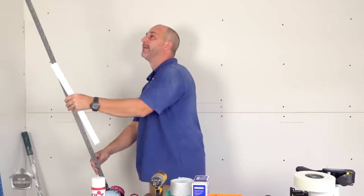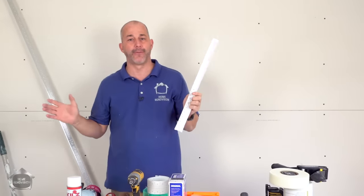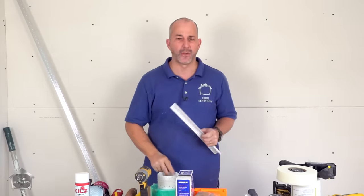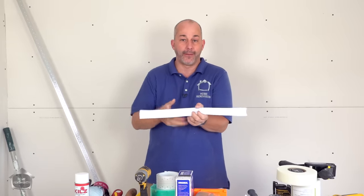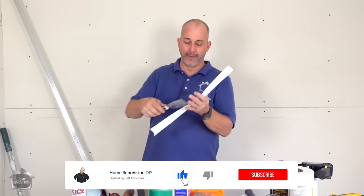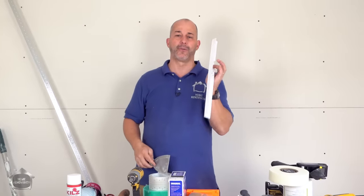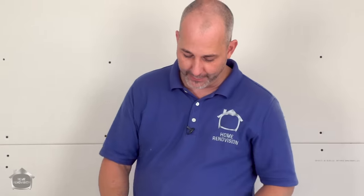Okay, now, this is kind of cool just to have in the box in case you ever need it, right? It's that last minute, I gotta roll the corner bead right here just in case. What are you, like 3 feet short, or you got a tricky spot? You can peel that, you can apply the drywall compound, stick it in, use your 4-inch knife, press down the edges, and then fill in from that ridge. And it's strong enough that you can actually use your metal tools on it and treat it like a metal corner bead. That stuff is money in the bank if you ever run into trouble.